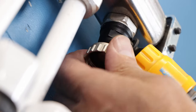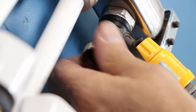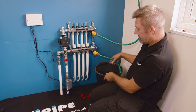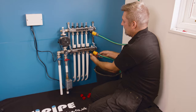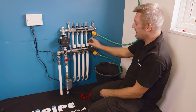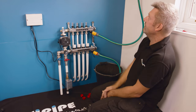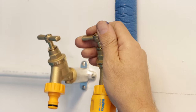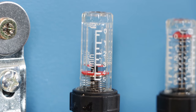With a little key we're going to open up the tap that lives below the fill and vent port, then repeat that on the one going into our bucket. Before we start, just to confirm: isolation valves are closed, all actuator ports are open, all flow meters are closed apart from the furthest one, which is fully open. As soon as we introduce water we should see the flow meter dropping down on the front here, confirming there's a flow of water going into this particular loop.